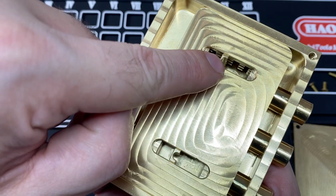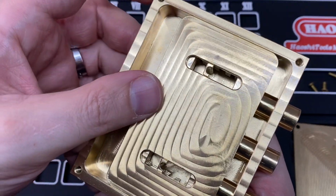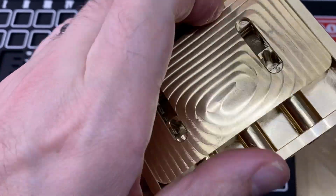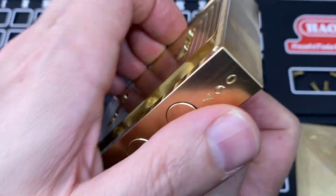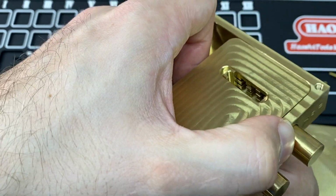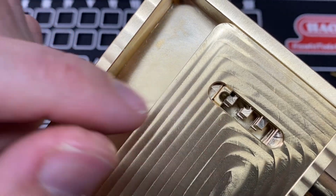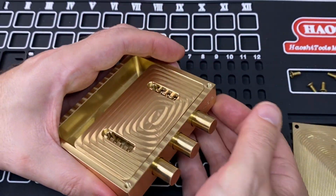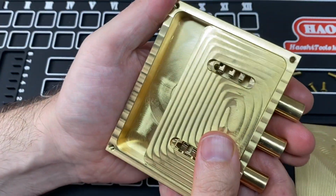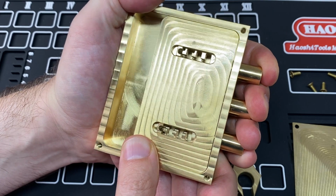You can see here that this bolt stump has to go past these little gates all the way across. So it has to go all the way across smoothly to retract the bolts out. If you haven't lifted these gates up all the way, then what will happen is that these little teeth will interact with the cutout and the bolt stump, grip in like this, and you won't be able to move that wafer up out of the way again. You'll have to backtrack out. It's a very, very cool design indeed, and some precision engineering.